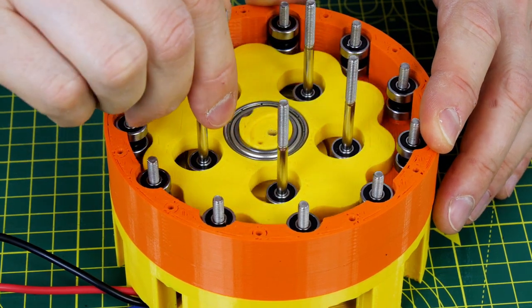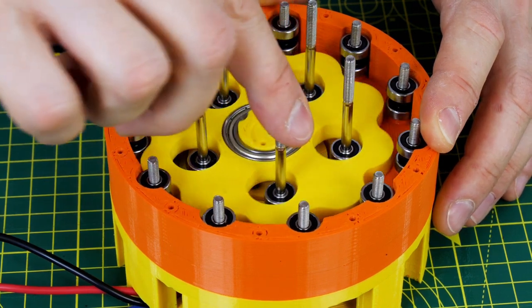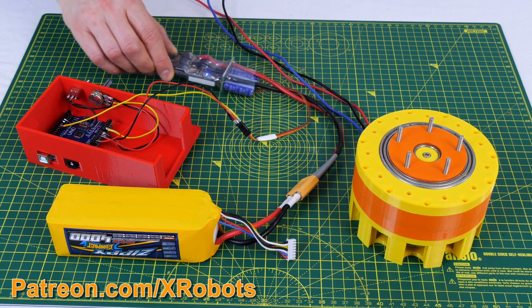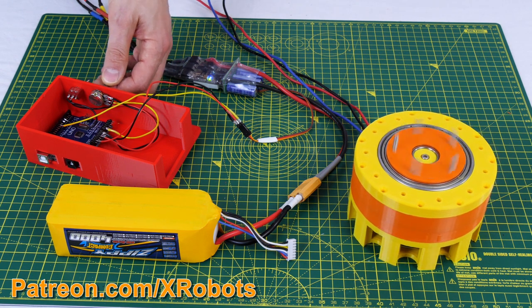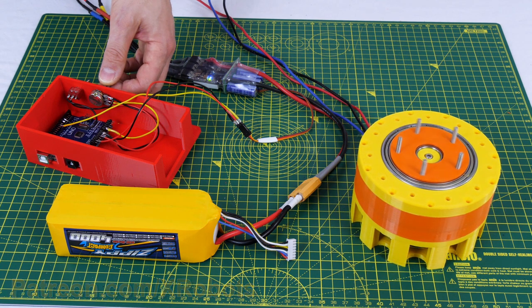Over the last few weeks I produced a prototyped cycloidal drive reducer and also a strain wave or harmonic drive reducer, which you can find on my channel. I previously only tested these with a sensorless skateboard ESC which made the motor turn, but it only uses the back EMF from the coils to work out the motor position. This makes it hard to apply holding power, and if the motor stalls, torque drops significantly.